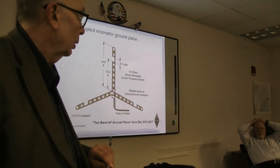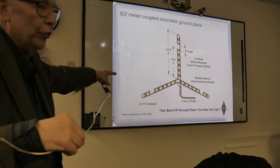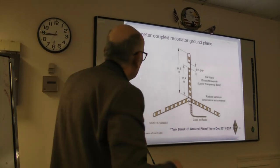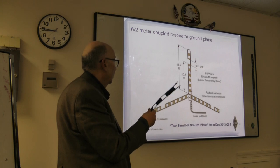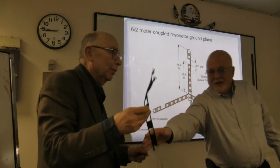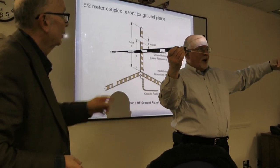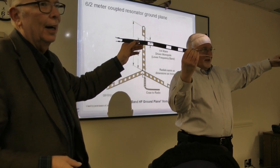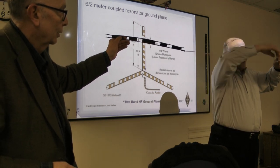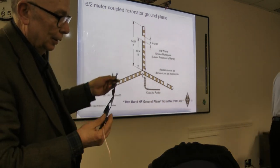It's one option. You need to step back from it. You haven't explained why you've got a piece of wire dangling out there, and none of these pictures have any wire. Yeah, because this is the folded version, and this is the unfolded version. That's why. Well, no. What you've done is you've replaced a section of the ladder line, which is expensive stuff. How much does it cost? The ladder line's 50 cents a foot, and this is about 5 cents a foot. So with one of these antennas, you're normally going to cut and not use part of that ladder line. So why use 50 cent ladder line when you can use 5 cent wire? You could just as easily make this one piece of ladder line. Yes, you could. You're going to cut here, so the top piece of the ladder line isn't used in any way. So Fred is saving some money, but that's why he's doing it. Yeah, and for frugal.